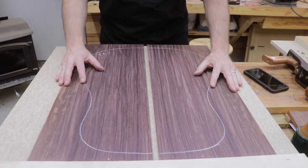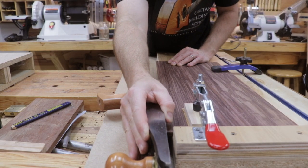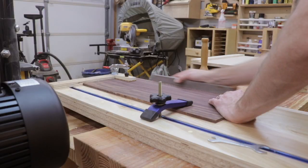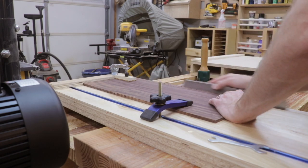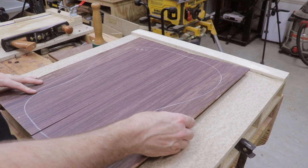The first step to build the back of the guitar was to joint the edge of the boards so that they can be glued together without any gaps. This joint is critical to the structure of the guitar, the joint must be as perfect as possible. The jointing board was built for this purpose. It's a great tool for edging the thin sides. Attempting to joint the boards upright in my vise would likely end miserably with failure.